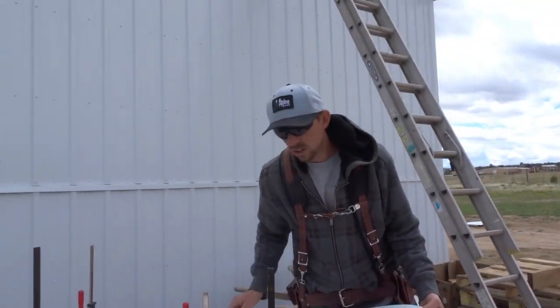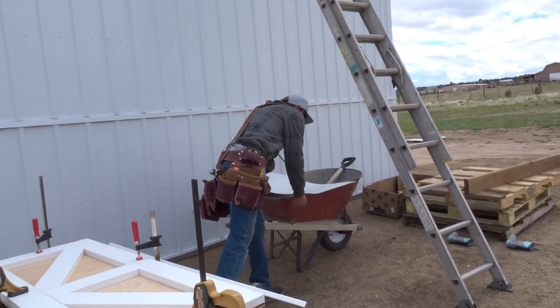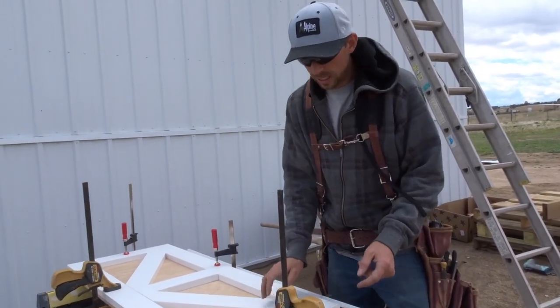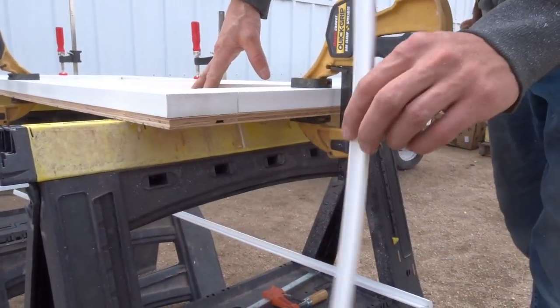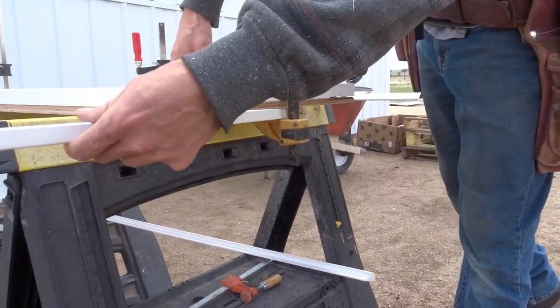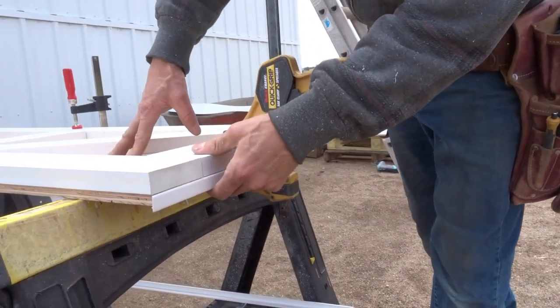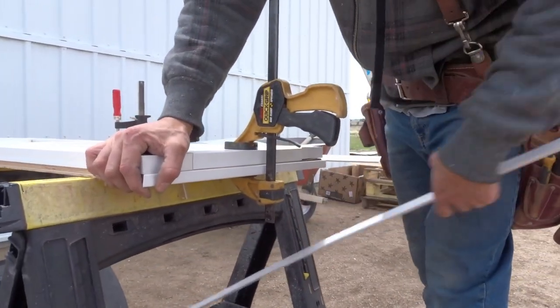And then it is all waterproof. But before I do that, see this end grain on this plywood? I don't want to see it. So I'm just taking this PVC outside corner, and I actually went ahead and cut them, and it's going to cover up that edge. I'm going to take the yellow on.